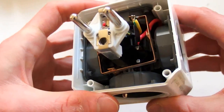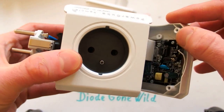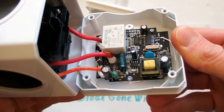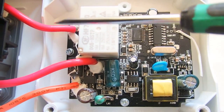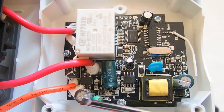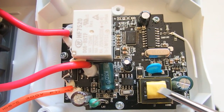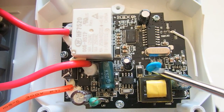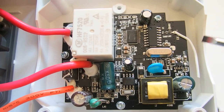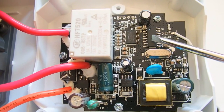There are some wires but I don't see any electronics yet. This one just pops out because it's held in place by the screws. And there's the board. There are three wires going into it — probably power in, power out, and control. There's a fuse, bridge rectifier, capacitor, inductor, another capacitor. There's probably a switching IC, a switching transformer, another capacitor, and an interference capacitor. There's a crystal at 16 MHz. There's a chip without any marking but I think it's an RF receiver — probably Synoxo SYN470 or something like that.